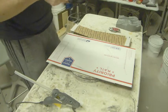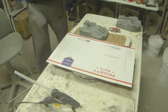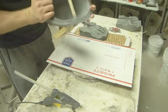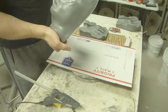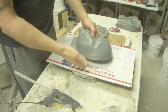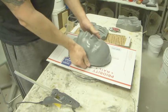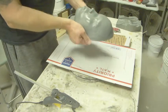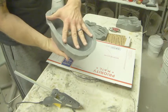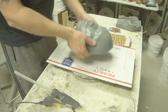Now if I was molding this, okay, this is a form for sculpting. It's made out of the same material, BJB 1630, and if I was making a mold of that, because it's hollow underneath, you run the risk of silicone getting underneath and then it floating to the surface and your mold is ruined. If you're wanting to mold something like this that has a hollow area, or maybe even if the back was solid, if it's light, it's going to end up floating.